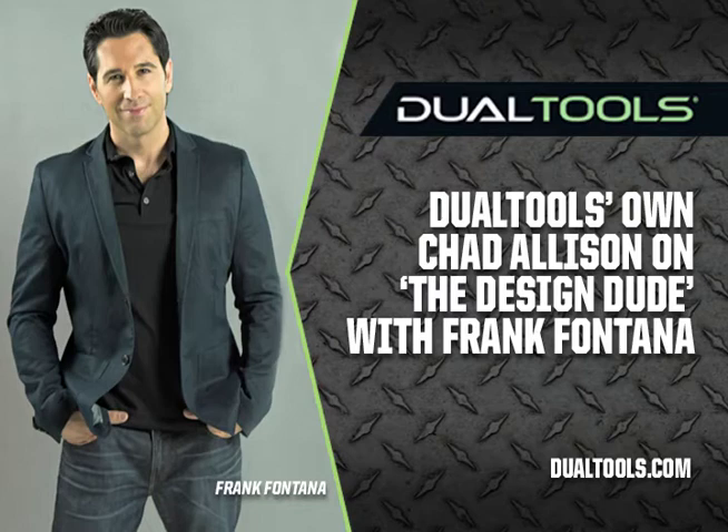Now let's talk about the OS3000 oscillating tool. The oscillating tool market just exploded over the last ten years in North America, and we looked at what we could do to make it better — put the user back in control. If you've ever used a single blade oscillating tool, it doesn't necessarily kick back like a reciprocating saw but it vibrates heavily. You're only working with about 2.3 to 3.2 degrees of stroke, so it's not overly aggressive but it vibrates a lot.